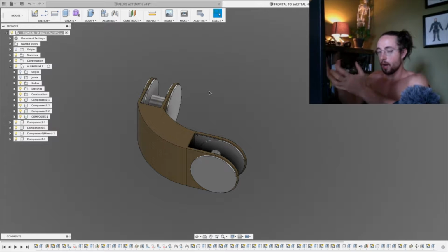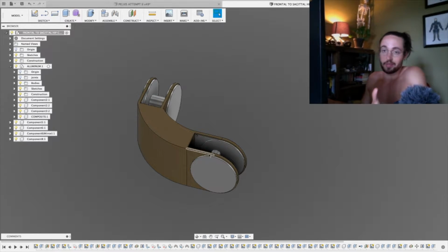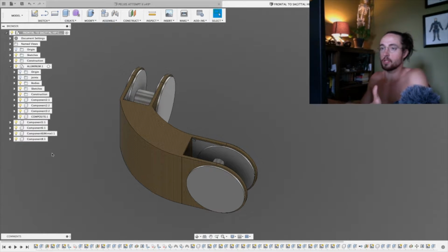And you'll notice that all the composite is on the outside and all the aluminum is on the inside, because the strength of a pipe is mostly dependent on the strength of the skin. So you want the highest strength stuff on the outside, so you're going to make the composite all on the outside and essentially no composite on the inside, if that kind of makes sense. This is just how you design composites. That's why they're strong, because the skin of them is strong.